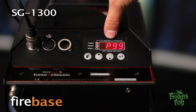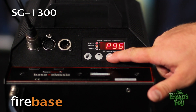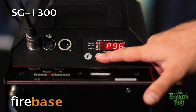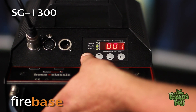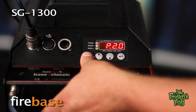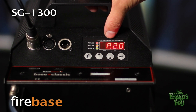The digital control panel on the back allows the user to calibrate the machine's functions. Select an output level from 1 to 99% using the up and down buttons. Access the timer by holding down the function button until the red timer light comes on, then press the function button once more to enter the pause time screen.